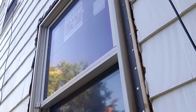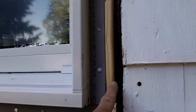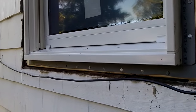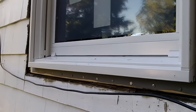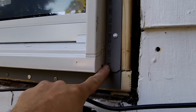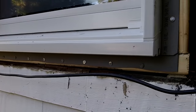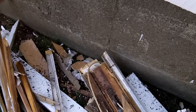The window is in - it went in smooth as usual. I added a little material here. The worst thing you can do putting a new window in an old house is go too big. This is technically a replacement window because we already had a hole in the house - we're just making it a little smaller. Home Depot or Lowe's would consider this new construction because it has a flange. A true replacement window is where you use the existing wood frame and just replace the panes, but that wood is usually so rotted - and you can see the old wood I took out is wonderful.